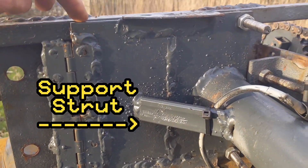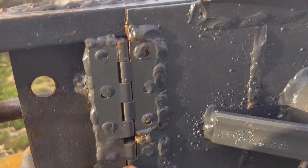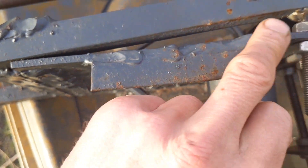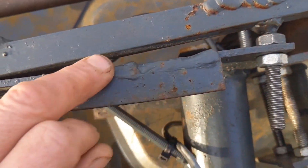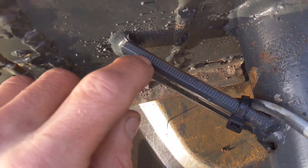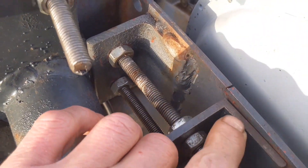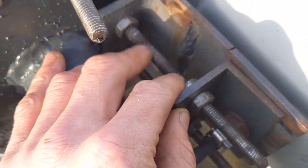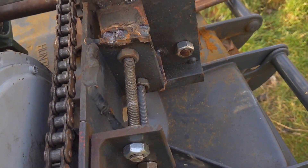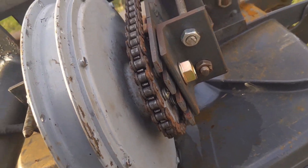Before that, let's have a quick look at the underneath of the turbine. This is the adjustment plate, which you can see is joined by hinges. This part is made from a flat plate. The tailpipe I welded on, and I welded on a bit of extra support there. The hinge is there. This is the rear motor mount so we can adjust the height of the motor from the back, and there's also one at the front. There's the chain and there's the electric bike motor.